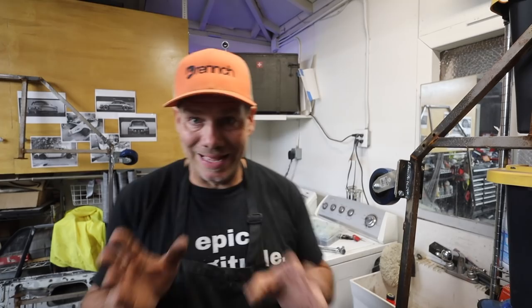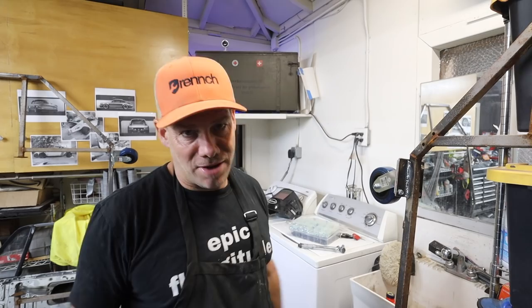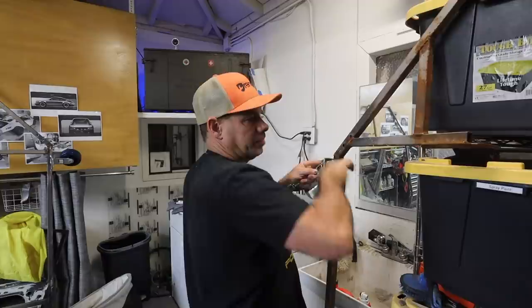So I made a hilarious mistake in that I welded the platforms 90 degrees off. However, all is not lost. All I have to do is return my rigid fixed casters back to Harbor Freight and then get two more of these swivel casters, and then all will be well. The swivel casters are the key here.